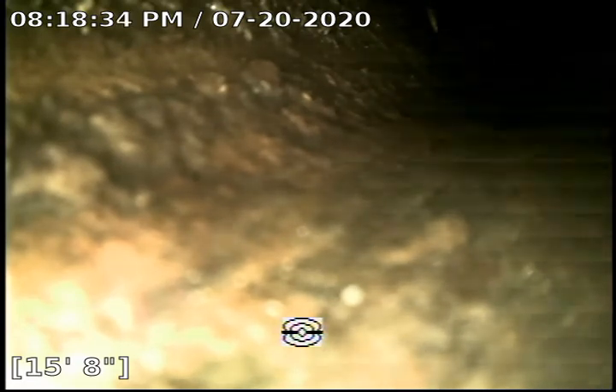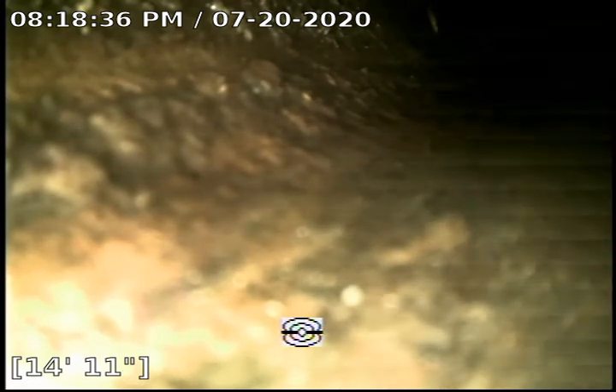Alright, we are back with recording. Apparently what we had was a backflow preventer that was installed on the sewer main in the crawl space, so we were kind of trapped in that area. The area where we have water puddling and collecting is right over the backflow device, and it is due to a negative slope in the sewer pipes.